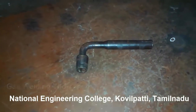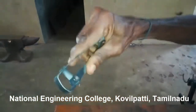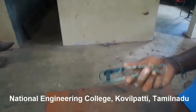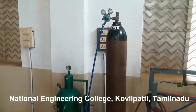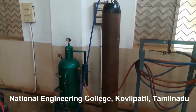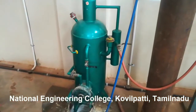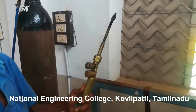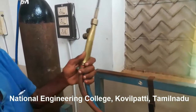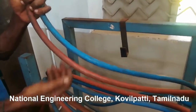This is known as a cylinder key. It is used for adjusting the flow of oxygen in the oxygen cylinder. This is a spark lighter, which is used for initiating the ignition process. Here you can see two cylinders — the black one is for oxygen, connected to a blue tube, and the green container is known as an acetylene generator. It is used for producing acetylene and is connected to an orange colored tube. Through this nozzle, the two gases are mixed and allowed to create a flame. The blue tube is for oxygen and the orange tube is for acetylene.